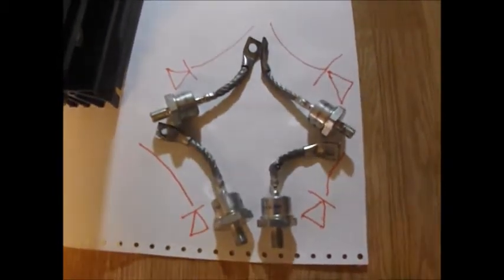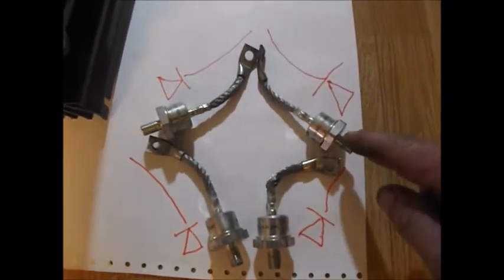Goes to the heat sink — both of them. So you can see them there, those big nuts, that's what's fastening them on. So they need to be wired in that way in order to do the conversion. So you have an AC line goes here — one line, one line — and then you have your DC output.